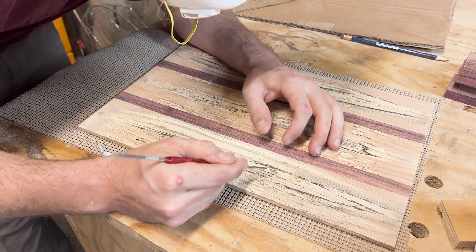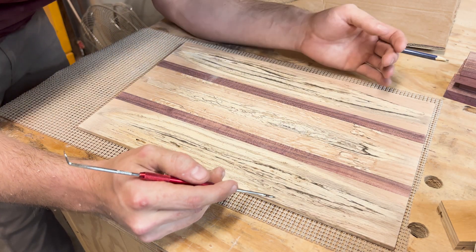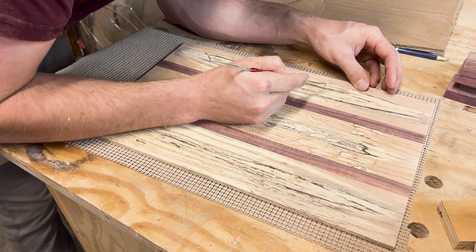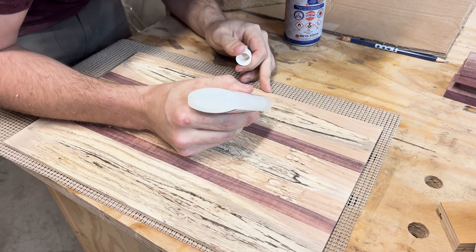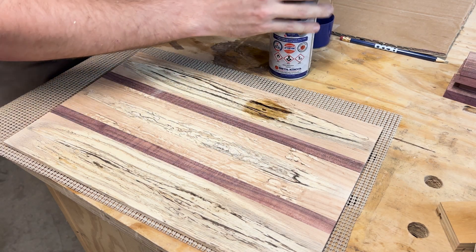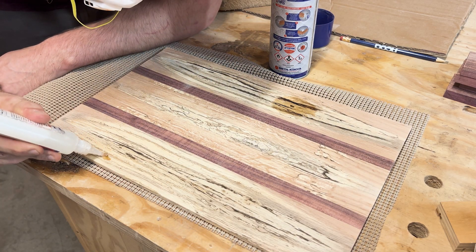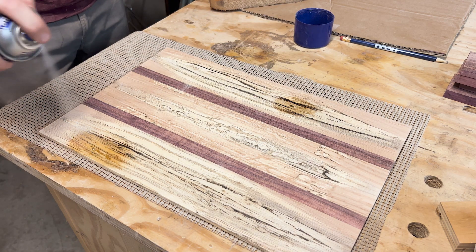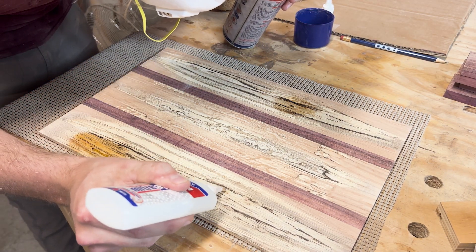Due to the maple spalting, that does mean it started to break down, and that often leads to soft spots. We don't want that in our final product, so I go through with a pick and remove any soft spots or rotten pieces of maple. I then use CA glue with an accelerator — it only takes about 10 seconds to dry and be workable. Then I sand down the CA glue and go over everything a couple of times. CA glue is really useful to fill voids in any piece, and to fix ex-girlfriends' cabinets when they lean on them a little too hard — but I always manage to get some on my hands, so I end up with super-glued fingers the rest of the day.